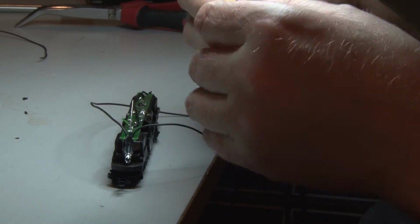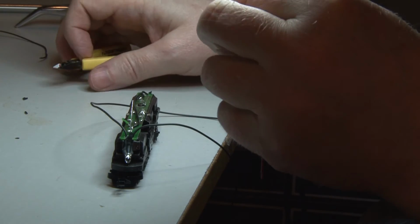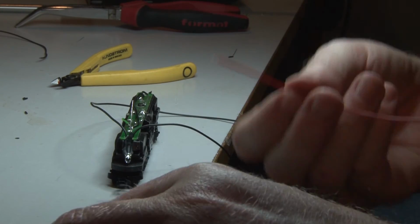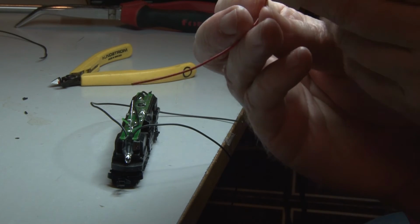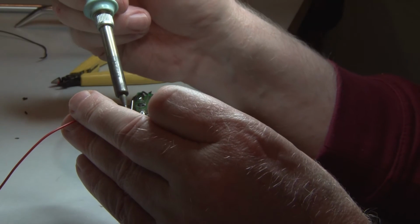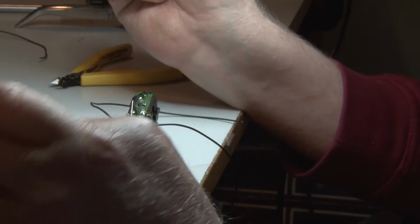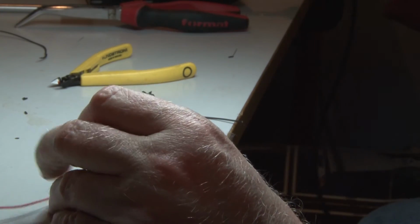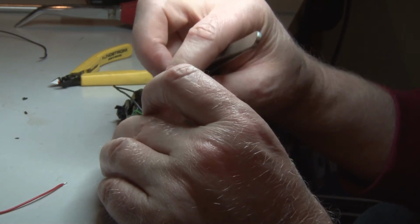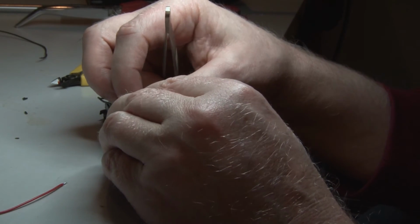And we have positioned the second LED. Here the distance for the ground is a bit longer, so we need to extend the resistor terminal. So we will solder some wires and make a good solid connection to the resistor. First out here.